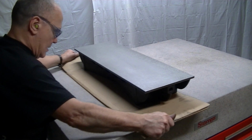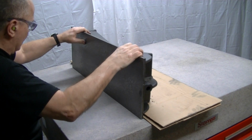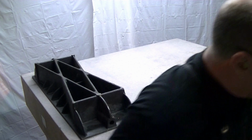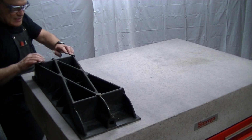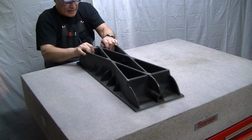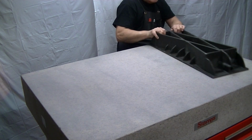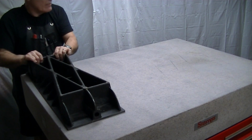The more free abrasives there are that are not embedded into the plate acting like a bonded grinding wheel, the more wear you're going to get on the plate, because you're going to get tumbling action as opposed to just the cutting action of a particle that's embedded and rigidly held in the plate. So this should sound pretty crispy with fresh charge in here. I'm going to take a quick run down the plate here to get the material.